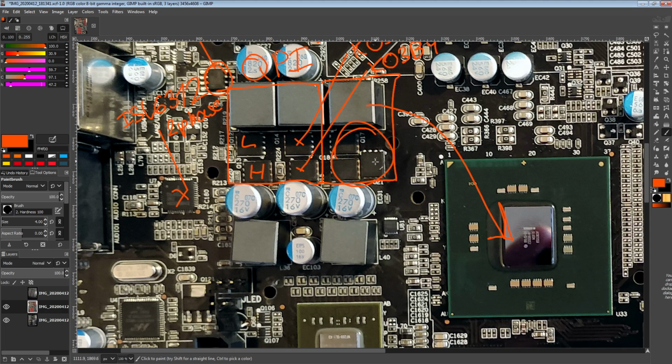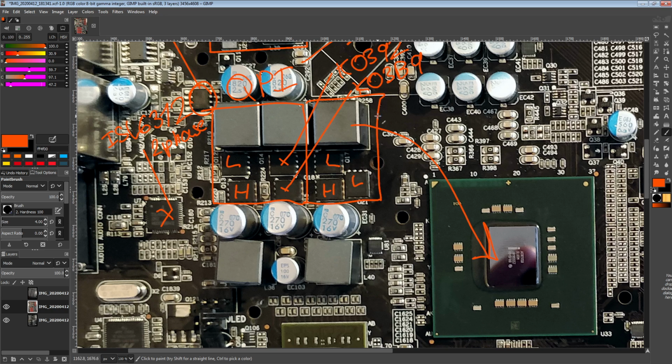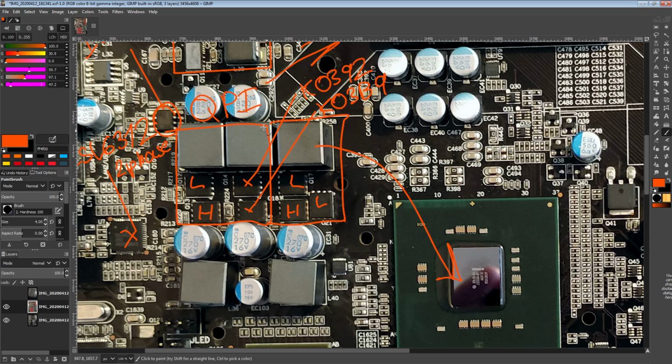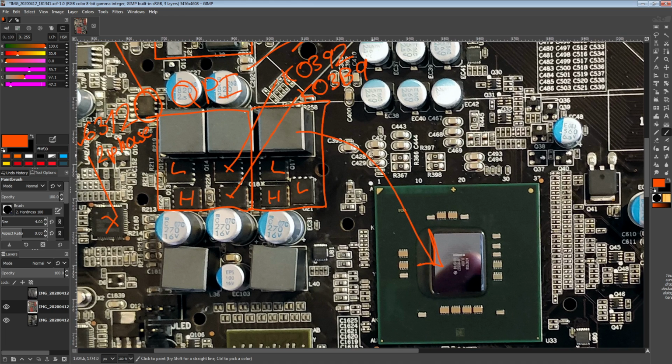And so you might notice there's 3 MOSFETs in this, and the idea behind this is you have a high side and 2 low sides, and by putting 2 low sides in parallel, you cut down your RDS on, and so your conduction losses get significantly reduced because most of the current going through a VRM goes through the low side MOSFETs. So if you have less RDS on, you have less power loss due to current flow. Anyway, this actually achieves similar efficiencies to the QPI link. But it's ever so slightly worse because it lacks the extra high side, and in reality I don't account for power losses through the inductors, and having 2 inductors reduces those as well. So this is actually quite a bit less efficient, but not by a huge amount.